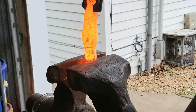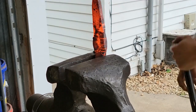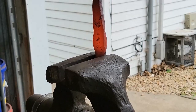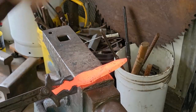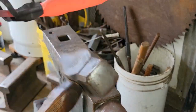At the blacksmith's advice, I like to clamp it in there and then use the tongs to pry my edge over, so when I start forging it out it forges out to the shape of a blade. That also allows me to hammer on the backside to remove the mass that is being drawn out when you hammer on it.